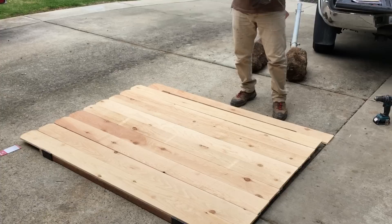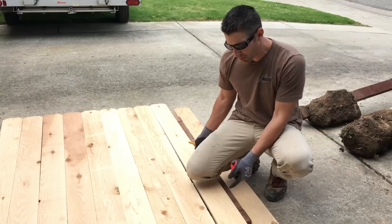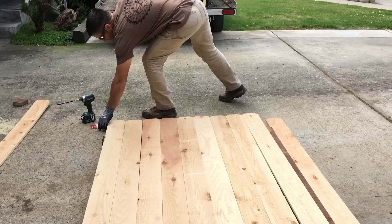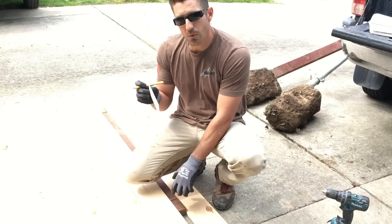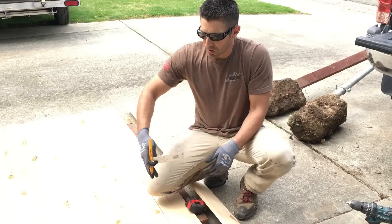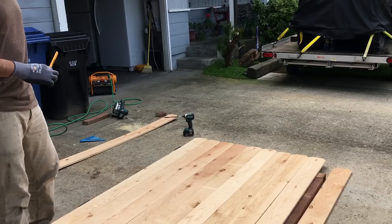Placing your fence boards on your frame is kind of a tricky thing, just like laying down flooring. You want to make sure you have enough boards to cover the area without a narrow little strip. Our boards are pretty wet because it's winter and they're cedar, so in the summer they're going to dry and shrink a lot. Even if I butt them up, they'll look like they have an eighth inch gap in summer. Just to be safe I grabbed a thin piece of cardboard — almost a sixteenth inch — to use as a spacer when nailing. Divide your overall gate width by the board width plus your gap, and that tells you how many boards you need. You can also center them and rip your end pieces so you get a nice centered look.